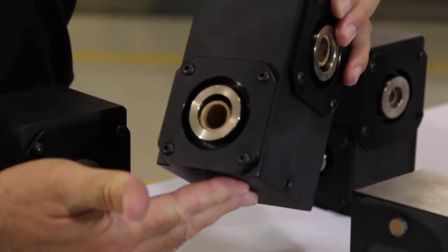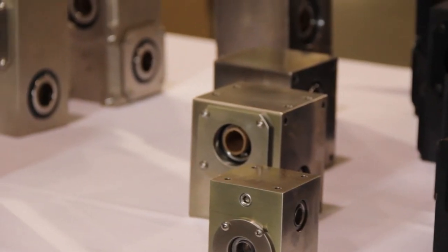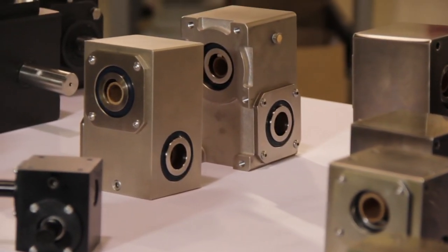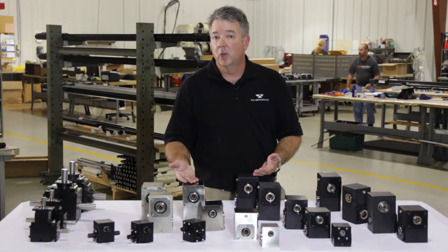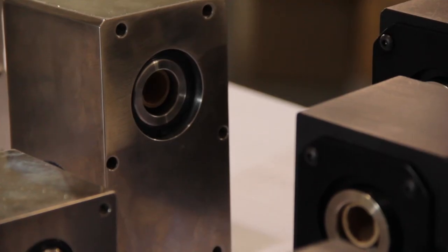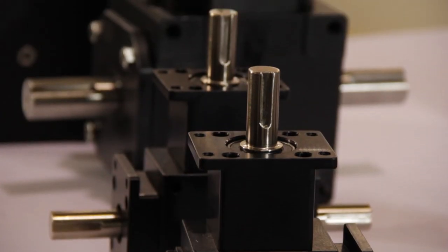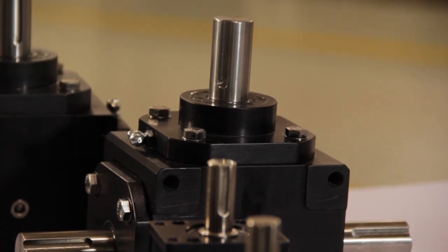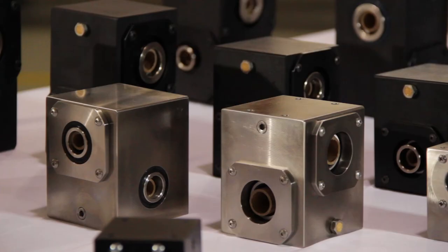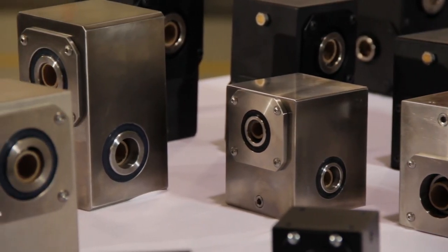Our standard configurations are nice black hard-coated cases. We also make a wide range of stainless steel gearboxes for wash-down uses in the food processing industry, or marine or other types of applications requiring additional environmental protection. Lastly, our spiral bevel gearboxes are offered in several different configurations whereby they run at high RPM and are one-to-one ratios. Insert-a-shaft gearboxes range in one-to-one ratios and also three-to-two and two-to-one ratios.